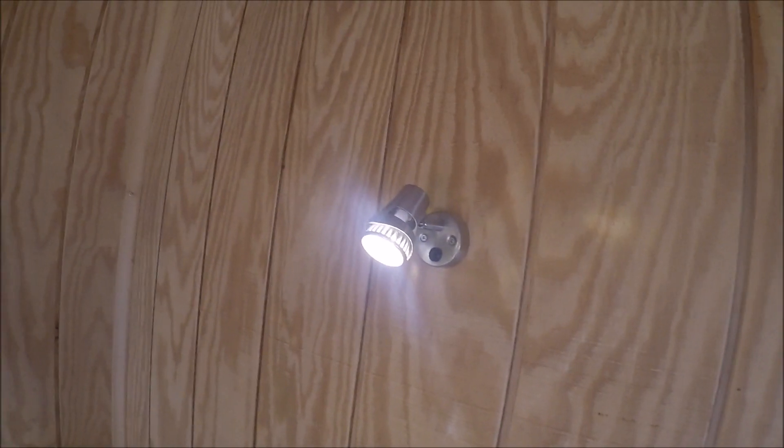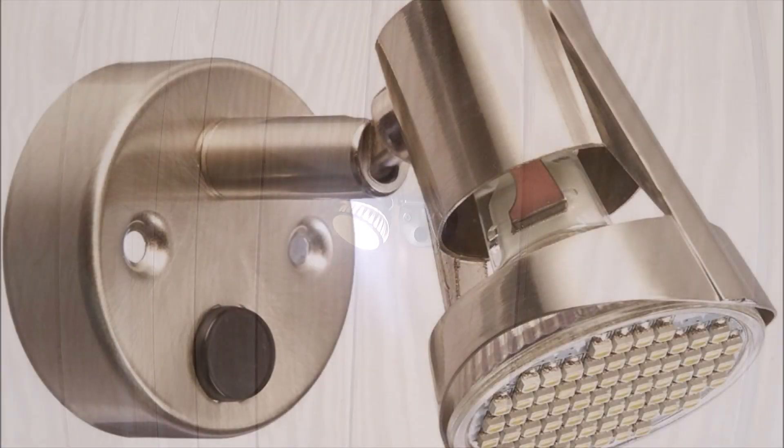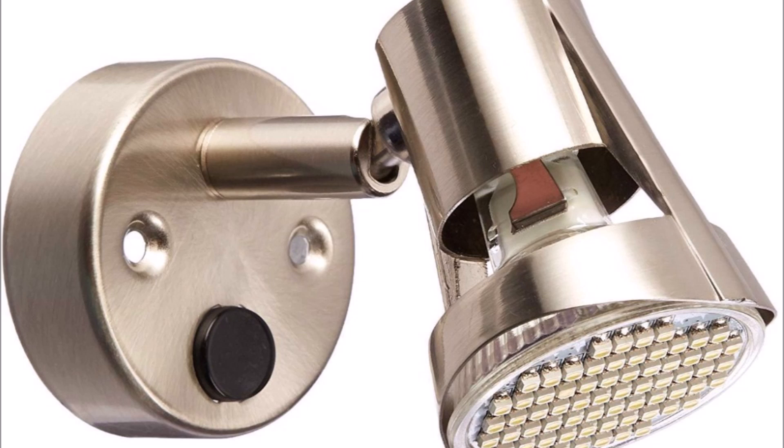You might wonder what kind of lighting I used throughout the cabin. I found these on eBay and purchased about 15 of them, strategically placed in the cabin pointing toward the ceiling and at each one of the bunks. They run on 3 tenths of an amp and they pivot to point in almost any direction. They also have an individual on/off switch. The low amperage means that if I left one of these on, it would take about 17 days to drain my battery.